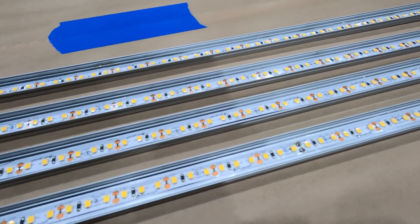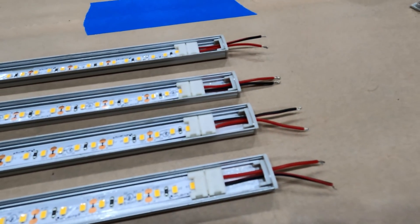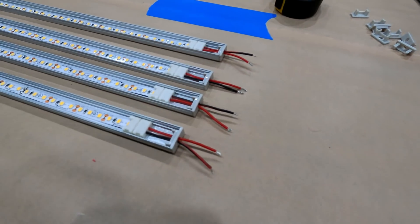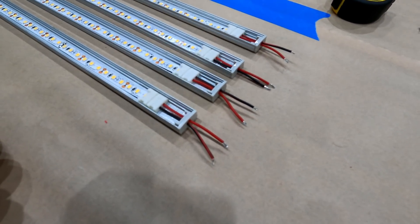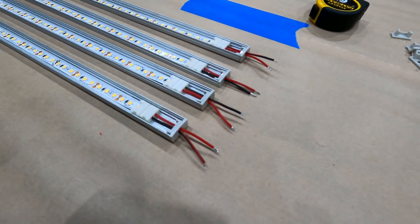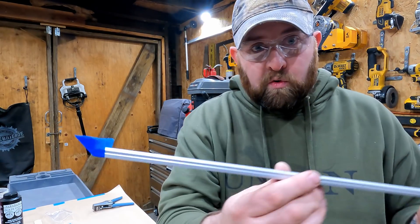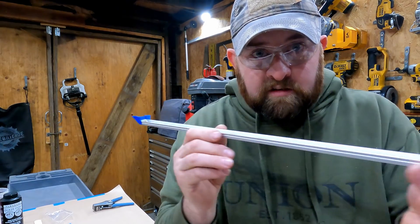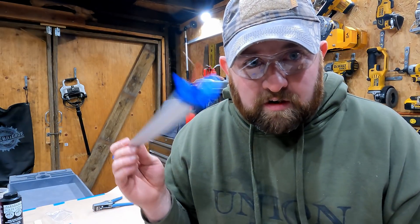You can see the LED lights sitting in the C-channel with the little connectors at the very end, and where the holes come out for the wires. The wires are a little short here but I can connect and add any type of connection I want later — I'll probably go with the barrel plug connectors. In preparation for the resin pour, I went ahead and taped off the very ends of the C-channel. Even with the little caps in there, if you've worked with resin you know it can seep through every nook and cranny, so tape them up and do yourself a favor.